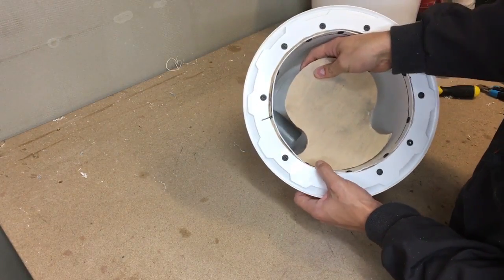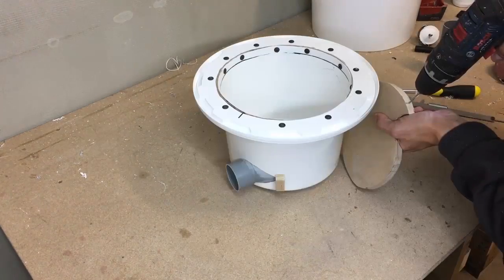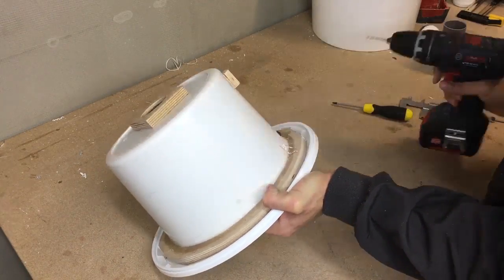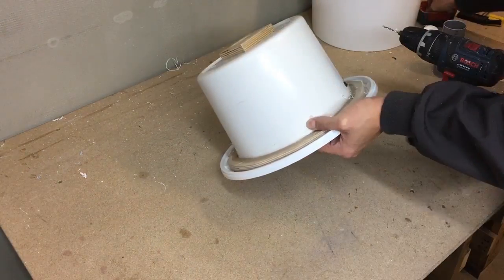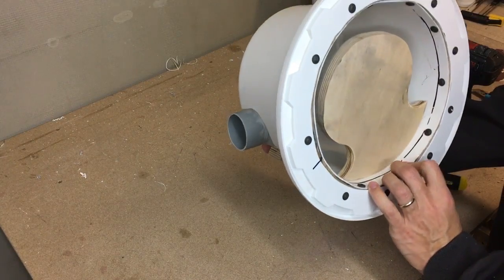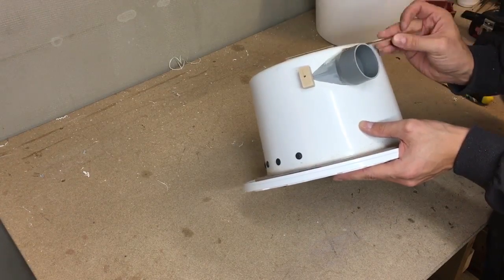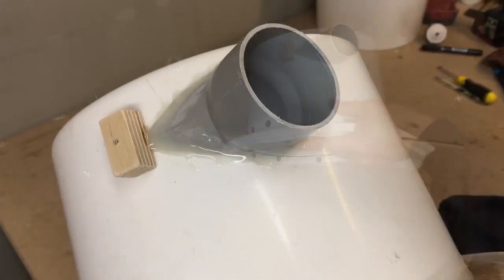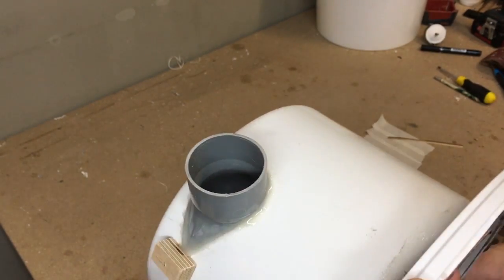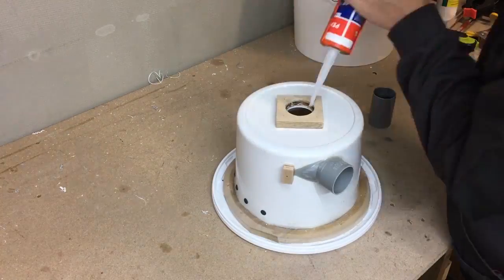It is time to measure a good place for the baffle and screw it in place. Drilled 50mm holes, applied silicone, and screwed everything in place. The two-component epoxy glue seals the joint line between the PVC elbow and the bucket. For the wire hose connection I cut an 85mm length PVC pipe and used silicone to glue and seal it in place.